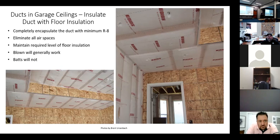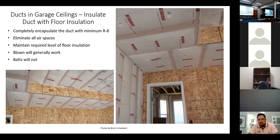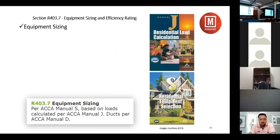If I were to build a house again, I'd do a 2x6 wall, put foam on the outside, and put an inch of foam on the inside for air sealing and stuff, and then I'd net and blow the balance of it. I think that's probably a pretty good wall, and it's most cost effective. Trying to spray foam an entire stud cavity full of foam is way more expensive, and there's other ways to do it better. So anyway, I think that's a good solution.